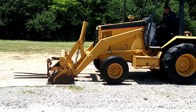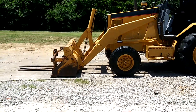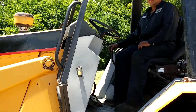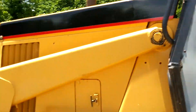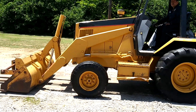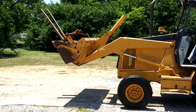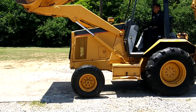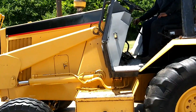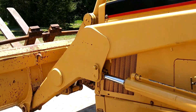We're demonstrating the front bucket issue now. He's got the joystick pulled all the way back and it's not raising at all — sometimes it'll raise just a little bit. Now when you tilt it, it goes right up. It'll pick up plenty of weight, and if you find the sweet spot you can get it to pick up straight and normal. It's definitely something just in that little joystick dial — it'll pick up every time when you tilt.